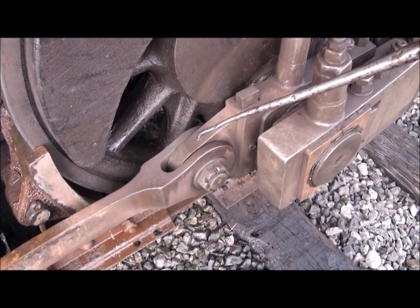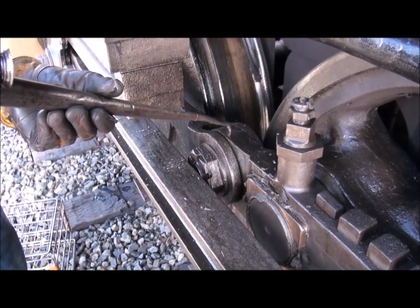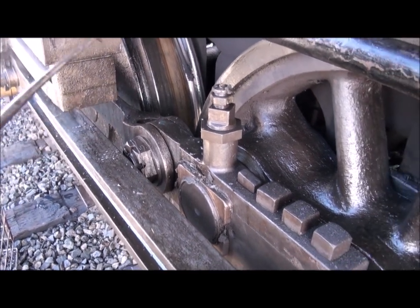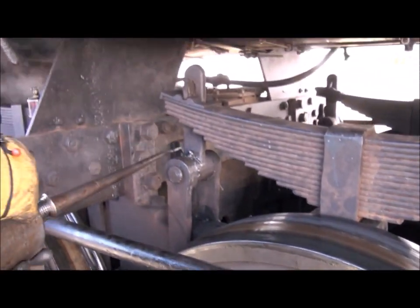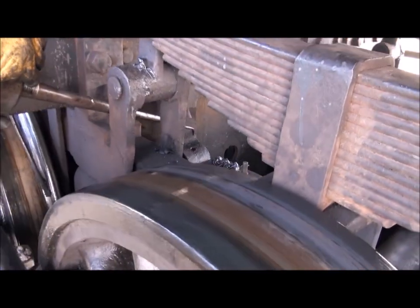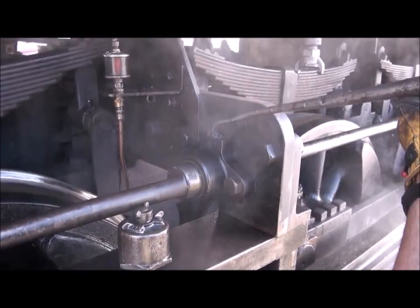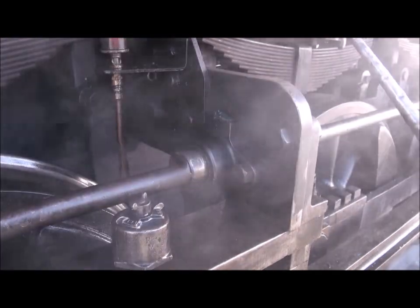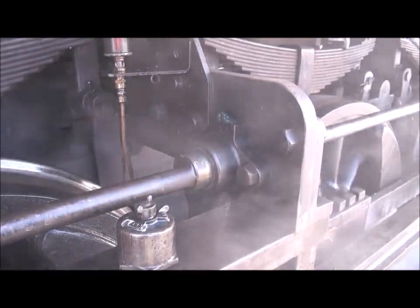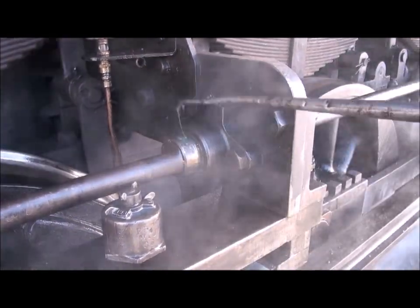From there, as I mentioned earlier, there are all these little holes all over the place. You just have to look for them. After you've done this a few times, you've got a pretty good idea of where they all are. Just make sure to get as many of them as you can when you can. There's another little hole inside of there, so just take your time and look around. Here's another lubricating point — this is a connector for the valve. Put a little bit in the wick, and then put a little bit around the area that it wears on.